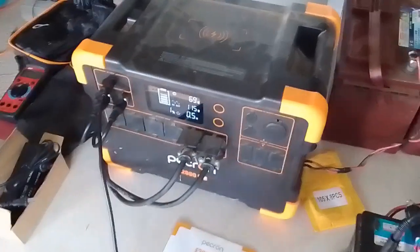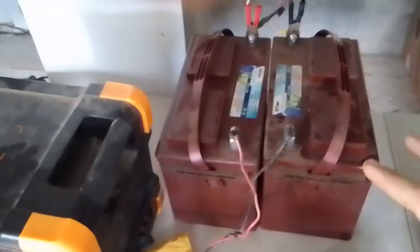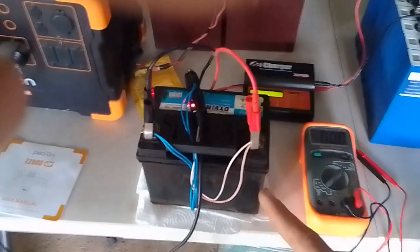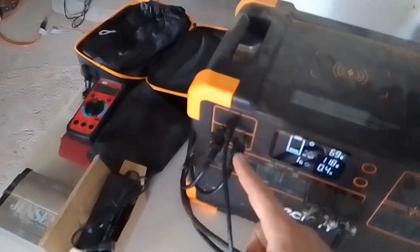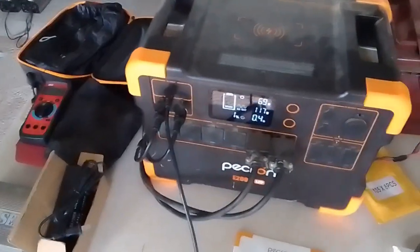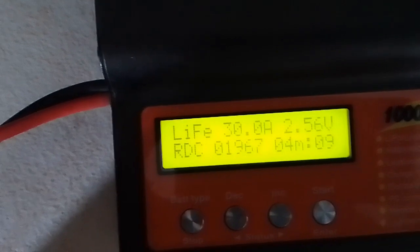Small update the next day in the morning. The battery is just about dead — these have a little more power in them than what it thinks. What I've done is my charger is now using this 12-volt battery from my generator, which is kaput. I just wired it to the cigarette lighter and that's going into the 12-volt DC input. So that's giving just a little over 40 watts worth of charge input. The most I'm pulling is about 70 watts.